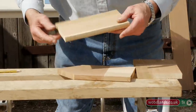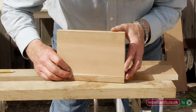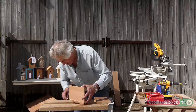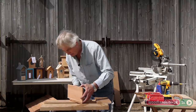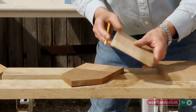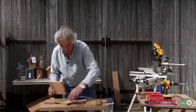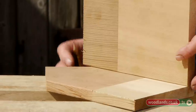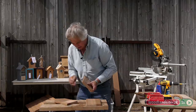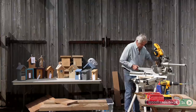I'm going to mark where I've got to cut the mitre top. I'm just using my fingers to check that they're nicely in line, and then I'm going to make a mark just there. Now that is the left side, so I'm going to mark both sides left and right. This is the other side now — another mark on there. It should be 45 degrees. So I know I can't go wrong now. Set the saw at 45 degrees again.